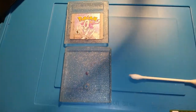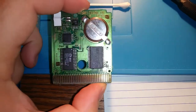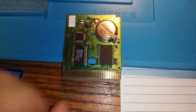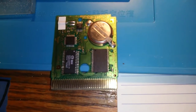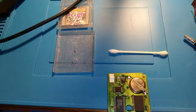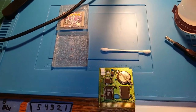I have a copy of Pokemon Crystal here, Game Boy Color. It's not booting up. It shows the Nintendo and the Game Boy splash screen and then just goes to a blank screen. On a lot of Game Boy games I've found that just reflowing these chips will do the trick a lot of times — just get some tin whiskers or pad lift, whatever — a cold joint at the factory. I'm going to try that and get the iron heated up now. I'm hoping this can be easy to repair. This game has become quite valuable, actually going for about $125 right now, so if I can get it working that would be great.